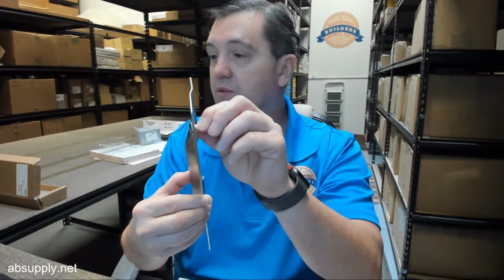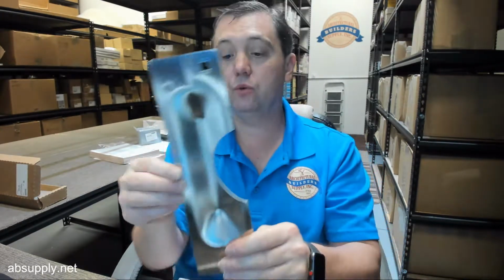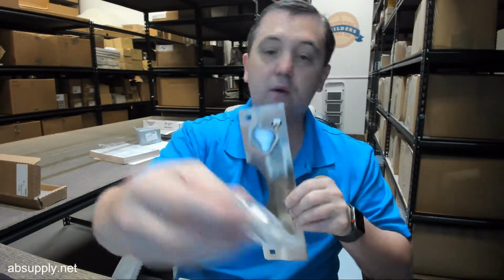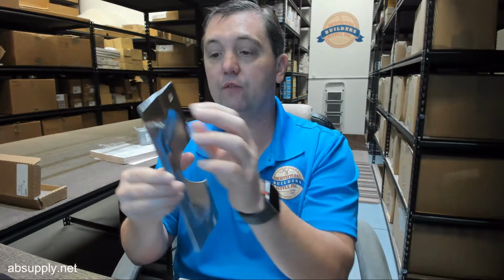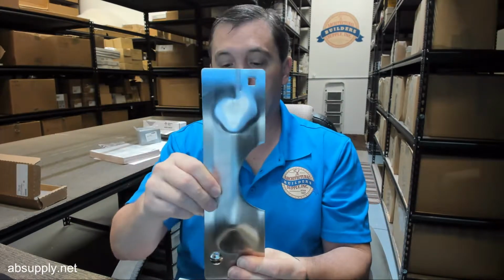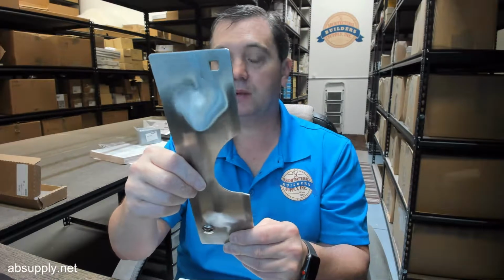The 320 series also features the anti-pry pin, and after this is installed with the bolts that are included, a couple of carriage style sex bolts, you'll bolt that through the door, and you'll drill a hole where this pin will just reside within that hole that you've drilled in the jamb. So on a left-hand reverse door, the pin will be towards the top. On a right-hand reverse door, the pin will be, of course, towards the bottom. Okay, that's how that is, making it not handed.